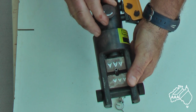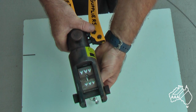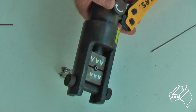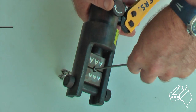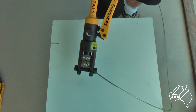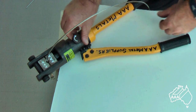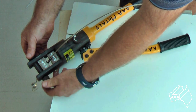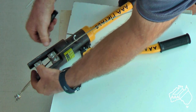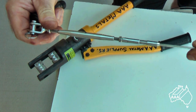First close the swager pump valve in a clockwise direction as indicated by the arrow. Next place the swage stud end of the rigging screw between the swage jaws and continue to pump until the stud is just being held by the jaws. Insert the wire and continue to pump the handle until firm pressure is applied. It should be noted that the two faces do not have to touch to create a strong crimp. After turning the pump valve anti-clockwise, remove the rigging screw swage by undoing the bar that holds the jaws in position. Check the swage end has a suitable crimp on it by comparing it to the sample crimp supplied. When done properly the tensile force required to pull the wire out is approximately 800 kilograms.